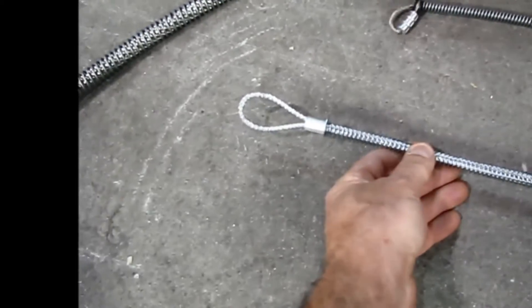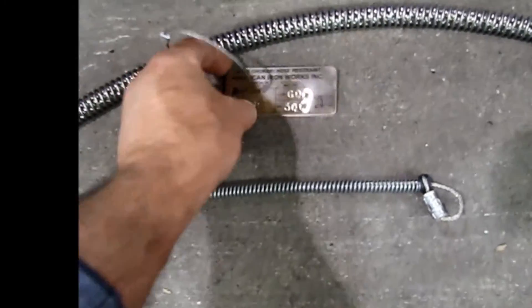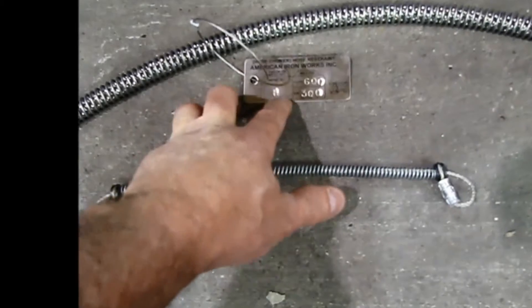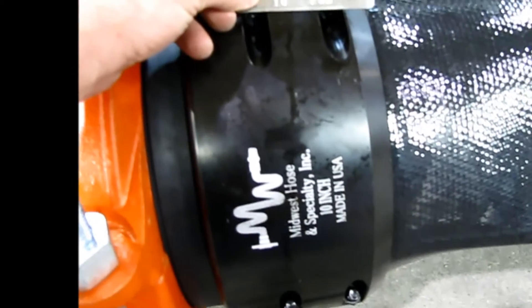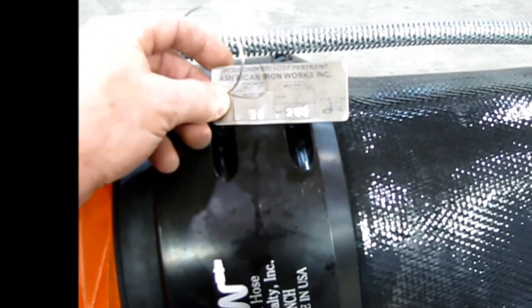The whip check is only rated for a maximum of 200 PSI, whereas on the cable choker we can get several thousand on the smaller ones. On the larger diameter hoses — on this one, which would be an 8-inch — 600 fluid, 300 air. On the 10-inch that we're testing this morning, it's tagged for a 10-inch at 200 PSI.